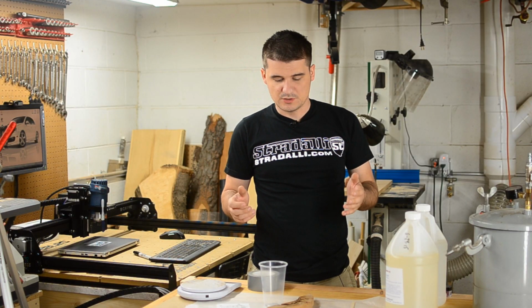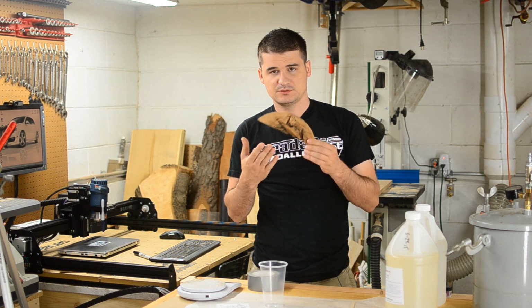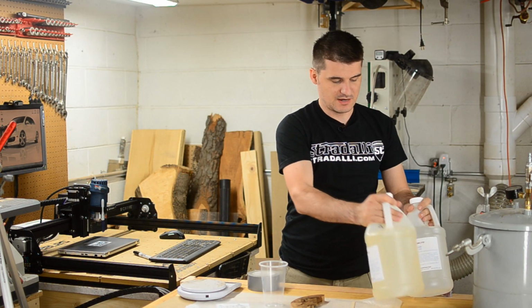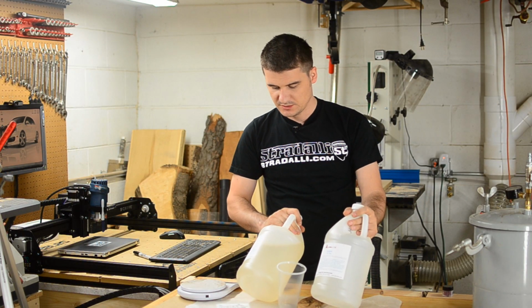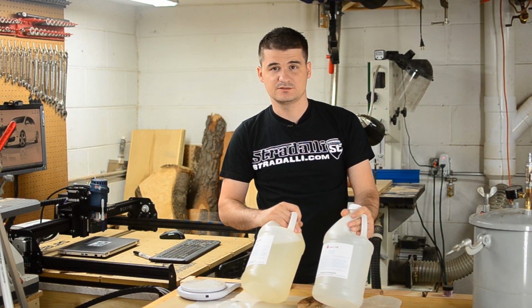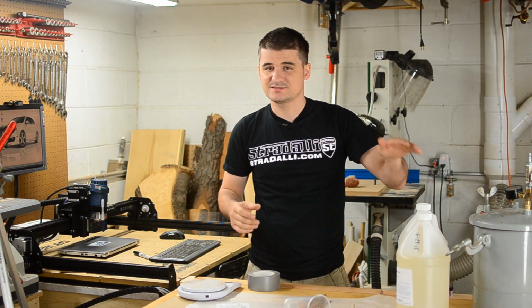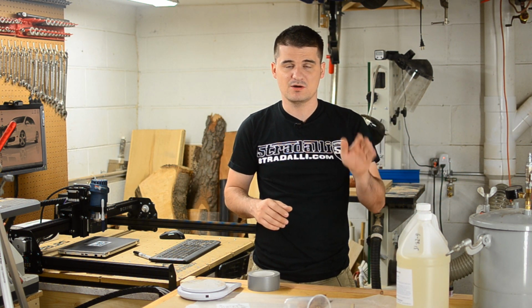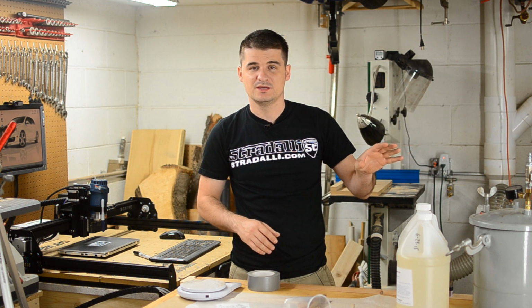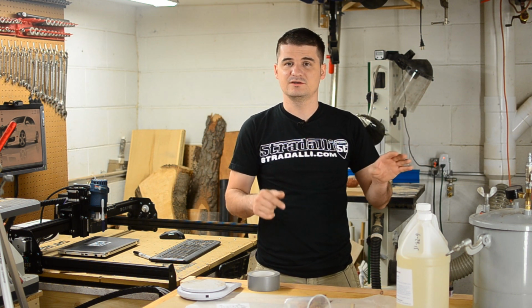So of course, for this project to work, you obviously need some type of scrap wood, such as what I have here. You're going to need some type of resin. In my case, I'm going to be using Alumilite clear, which is a two-part resin that's a 50-50 ratio. And you need a pressure pot that's capable of at least 45 pounds per square inch. The one I'm using is a Harbor Freight pressure pot. I've got more info on the pot and the setup that I have, and I'll have a link to that video down in the description.